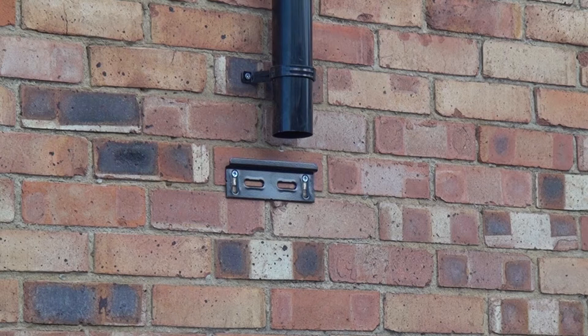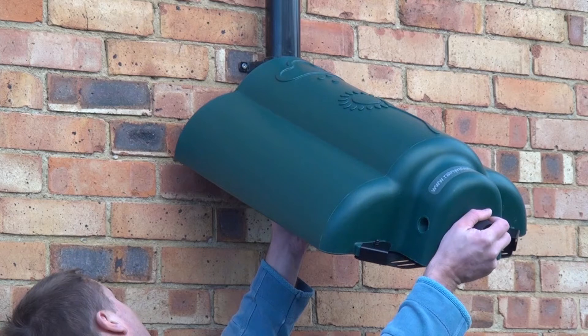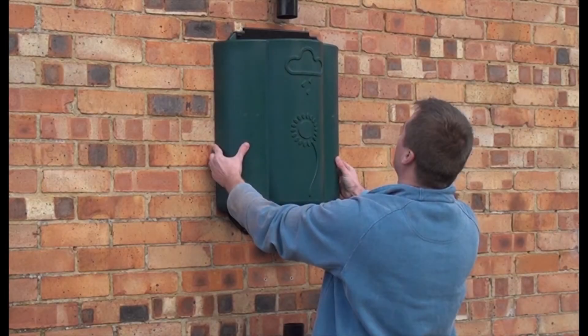You don't need to completely tighten this at the moment because this wall bracket is adjustable if you find that the rainwater hub does not sit perfectly straight on the wall. So the next thing to do is to clip on the rainwater hub — you do this by holding it up at approximately a 90 degree angle to the wall and clipping it onto the bracket, allowing it to fall back down flush with the wall, when you can stand back and check whether it's straight or not.